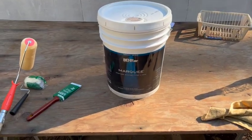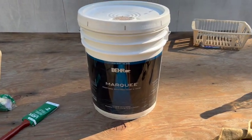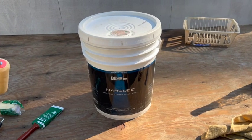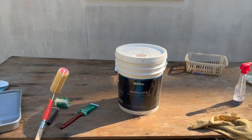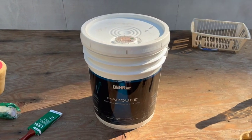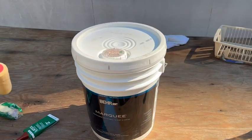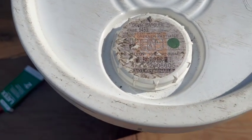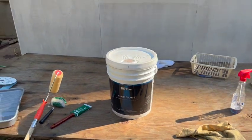All right, I'm going to paint the house today, or at least some of it. I went with the Behr Marquee — I think it's the highest end you can get at the depot. I kind of wanted to go with semi-gloss, but that's unusual for a base color. They suggested satin, and since I'm going with a darker color for the main house color, the color I picked — 'Greener Pastures' — only came in satin anyway, so it would have made a different shade in semi-gloss.